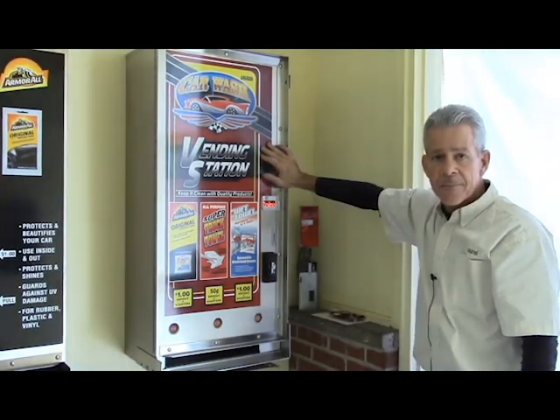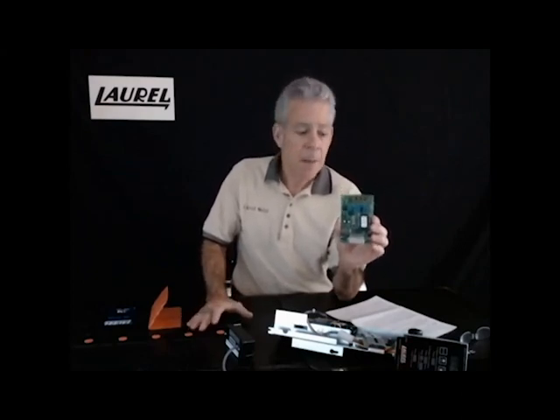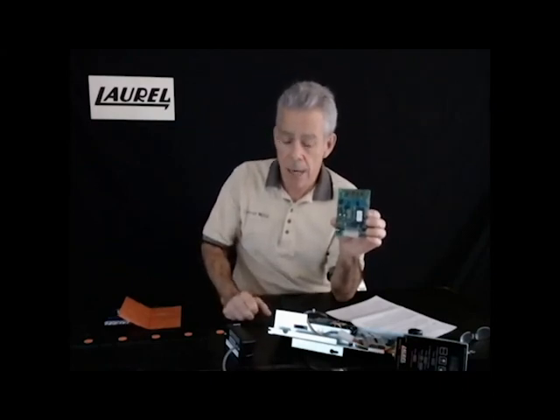There are plenty of machines still out there working fine with the old green boards. The first thing that does start to go is the LED display — sometimes you can't read it but the machine still functions. Eventually they'll need to be changed out, but you don't have to buy a whole new machine. Just upgrade to the new boards — we made them to fit right in the same spot, same size, same wire harnesses. The new Digimax circuit boards do offer a little more, and in the next video I'll show the programming steps and features.